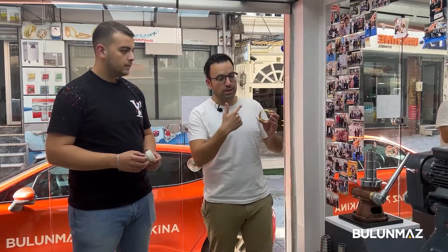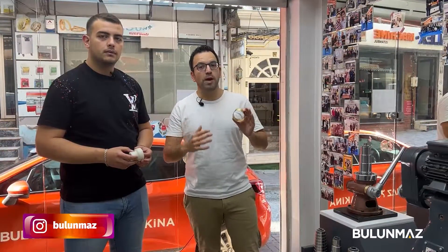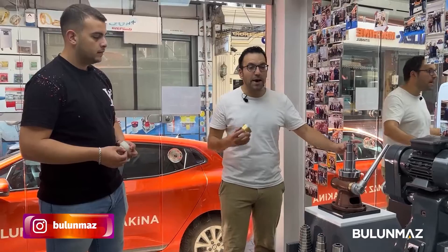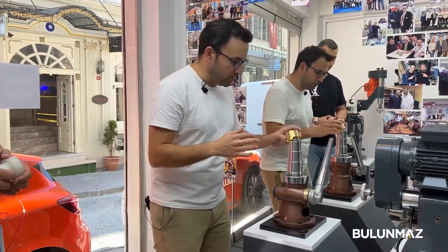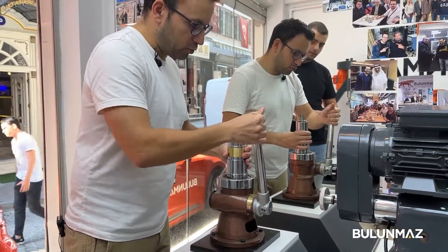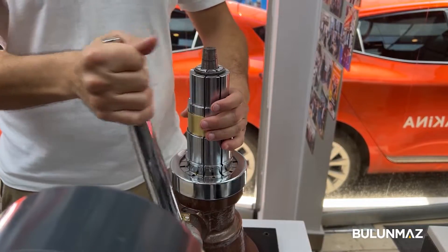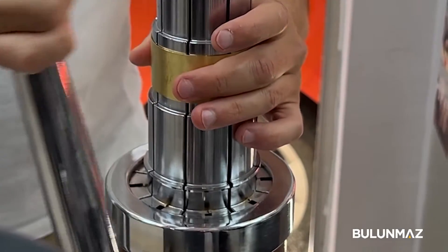But first we need to be sure that our bangle is perfectly round. There are several options to make your bangle round, but we are using a bangle forming machine. When you prepare your bangle and solder it, all you need to do is put it on the bangle former and tighten it until it becomes perfectly round. It has a really simple mechanism — when you pull with your hand, it just tightens the bangle and makes it a perfect round shape.